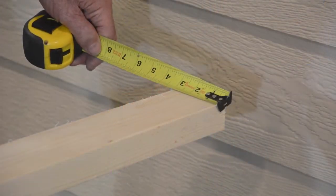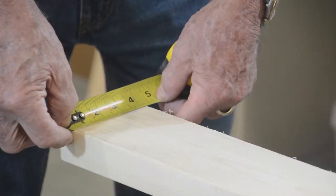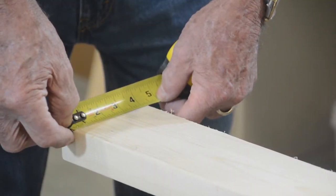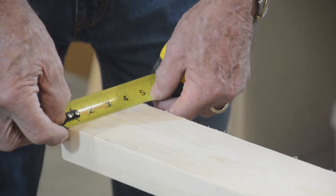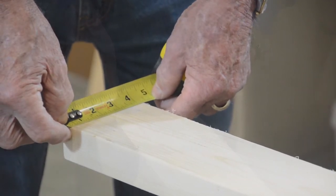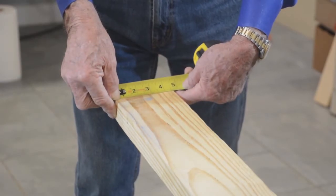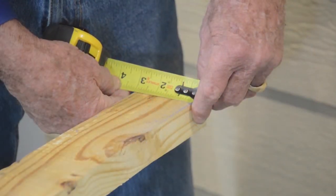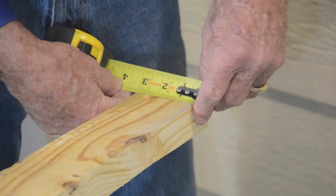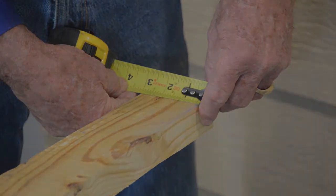The trim board on the right side of the underdeck is tapered from 3 inches to 4 1/8 inches to define the drop of the panels on the upstream side of the gutter. The trim board on the left or downstream side of the gutter is tapered from 4 1/8 inches at the gutter to 3 inches at the high side of the underdeck. These measurements correspond to the calculations made for the ceiling drop made at the gutter.